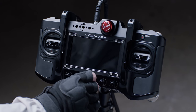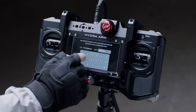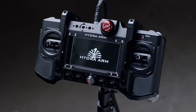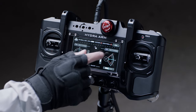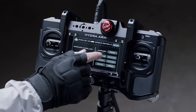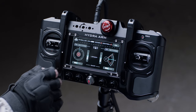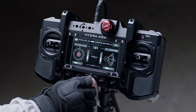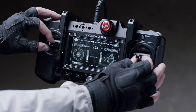When powering up your controller for the first time, you will need to turn your center dial to its middle position. You will then need to input your authorization key. To obtain an activation key, go to tilta.com/activate and enter the product ID on the remote control screen. Next, we will need to prepare our joysticks. Double press the lock to unlock the screen and enter the main menu in the top right corner before selecting device info. From there, press joystick cal — this will recalibrate the joysticks and fix any issues caused during shipping. Return to the main menu and lock the screen. You can then turn on the motor by twisting the red stop button, and turn the center dial one click to the right to activate control. Use the joysticks to pan the motor to the side of the vehicle for a better position to install the arm.